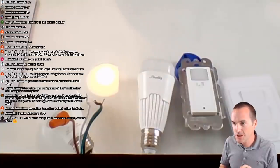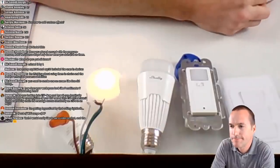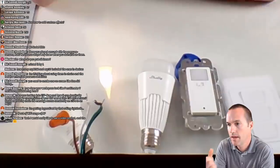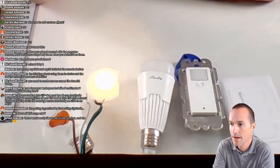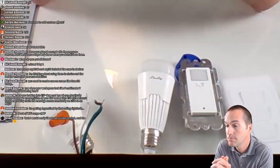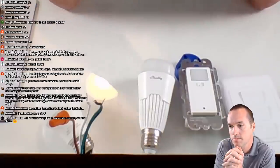I've played with ESP-NOW now, Jason. I didn't love it. I really like Wi-Fi for whatever reason. Because if you use ESP-NOW, then you basically have to have a hub, right? One of your Node MCUs is going to act as the hub for ESP-NOW, and the rest of them are going to transmit to that, and then the hub is going to hop back and forth between the ESP-NOW protocol and the Wi-Fi protocol, which is fine, but it's just a hub, and so if you're going to use a hub, why not use Zigbee or something like that?